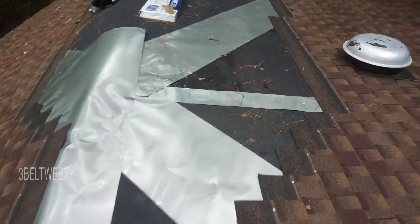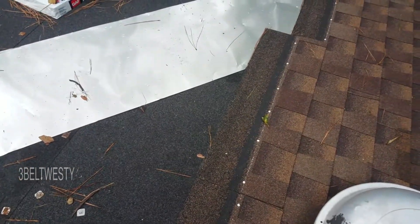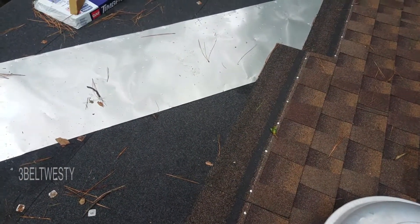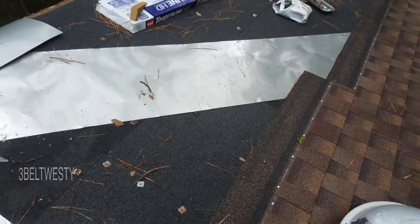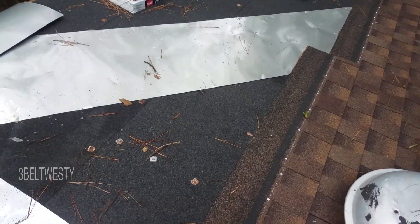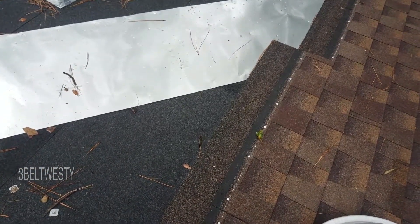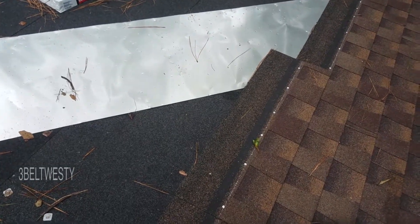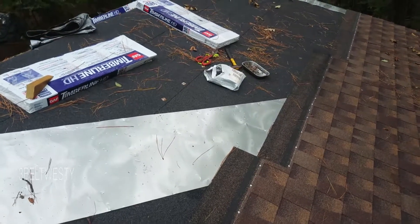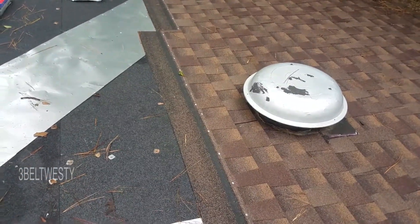Over here I had kind of a problem — I'm going to take that particular shingle off. There's one underneath where I went through and hit the nail line in the four-by-eight plywood at the end of the last project, and I never fixed it. I'll probably take that shingle off and a couple around it, and re-nail it slightly above the nail line, because there are nails not going into anything. I noticed it when I went underneath where the power vent was.